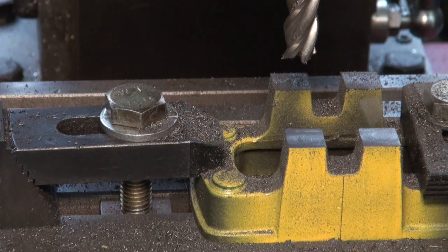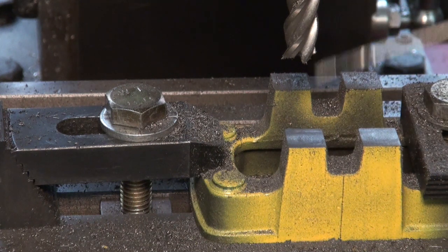So having got that to the correct height, I'm now going to try doing this pocket for the bearing brasses themselves, and I'm machining about 0.2 of a millimeter undersize, and I'll check it, and if necessary I'll do a clean-up pass, like a climb milling pass to finish.